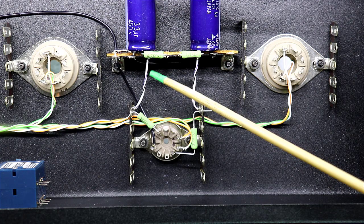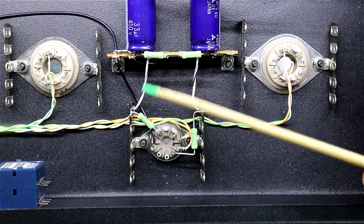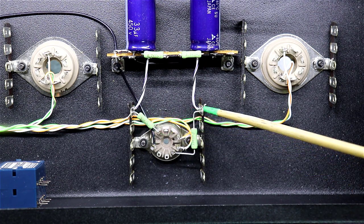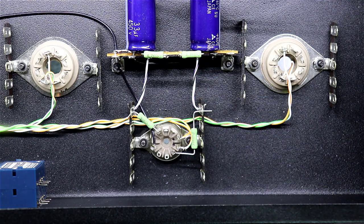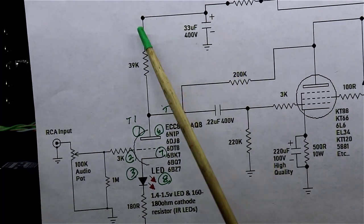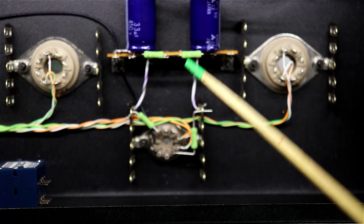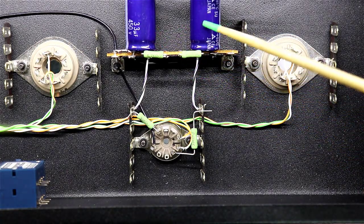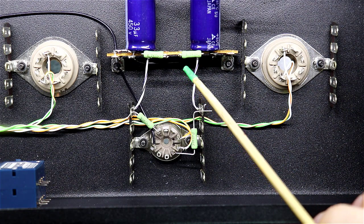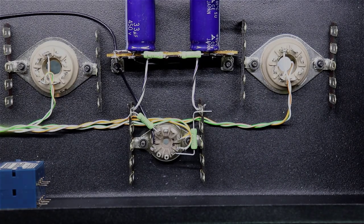And then we've, let's see, what else have we done? We've then ran our wires from the 4.7, the positive side of the capacitor, over here to where the connection point is to feed over to the 39K that's going to go to pins 1 and pin 6, and I did the same over here. So in essence, I've wired from B+, which I've not fed in yet, through the 4.7. I've got the 33 microfarad, then I've got the 39K coming over to two different places, pin 1 and pin 6. And if you'll notice, pin 1 and pin 6 are feeding off of two separate capacitors here. You might could have doubled that up, but I wanted to just try to start separating as much as I could along the way. Now I just need to feed from the center point back over to the B+, and we'll have this whole piece wired up.